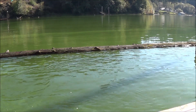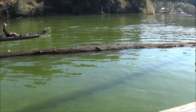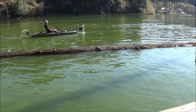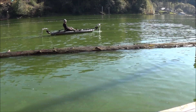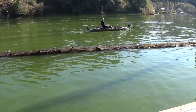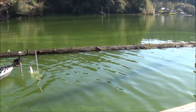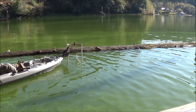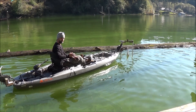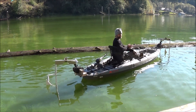Going a little straighter now as well. It doesn't work too bad — it could be a lot faster if we design some much thinner and smaller foils for this. The larger foils give us more torque but a little less speed. So now we'll design some smaller foils and test those out.